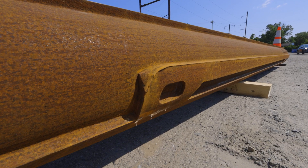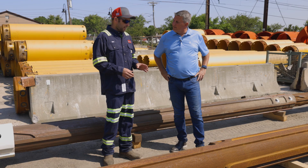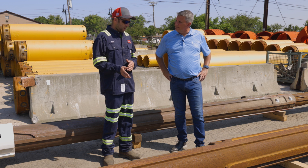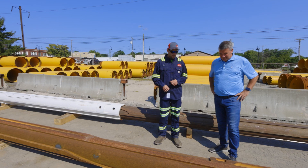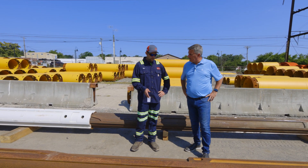As long as the wear is not too far gone — I believe it's 30 percent wear — as long as it's within that wear radius, we can grind it down, build it back up with weld, and make it match Bauer factory spec again. So as long as the wear is not too severe on the corners, we can repair it. Correct.